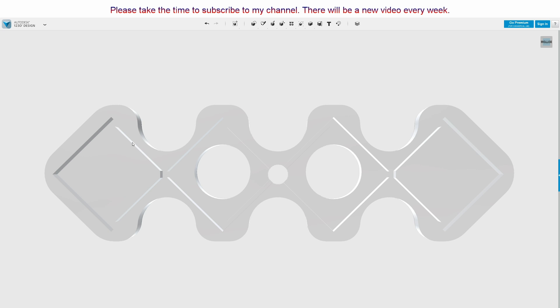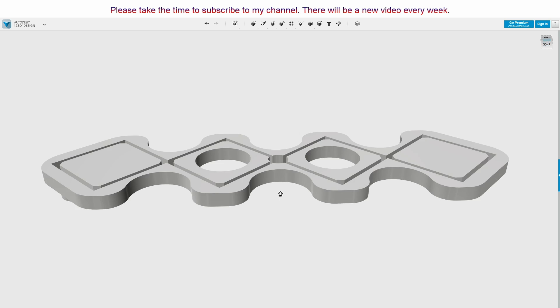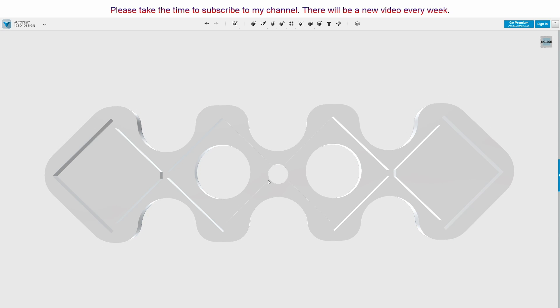Then you go all the way to the top corner, then to this corner, then you stop again. You place some insulation here because again you don't want the wires touching each other. Then you go straight up to this point, back to here, and fold it to the inside. Basically, at the bottom side there will be two wires coming down and those will both be connected to the ground. So you have one piece of wire from each side connected together — that will be the ground. The other wire coming from the middle will be the positive side of your antenna.